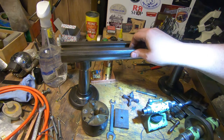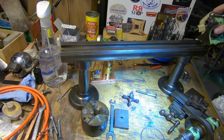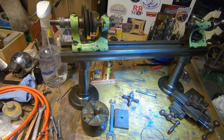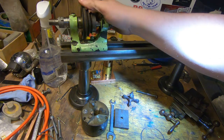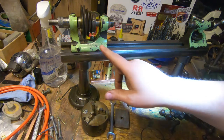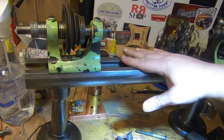The tailstock has a taper on one side and a square key on the other — it fits up against the bed and the taper pulls it in when you tighten the knob. The headstock has seen a bit of abuse; the bearings are somewhere between excellent and not too shabby, and the pulleys don't have any dings, which is good. The oil covers are missing, along with the two little dippers for the oilers. This is a very plain one — it's never been drilled and tapped for the detent for the index wheel on the back.